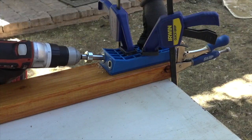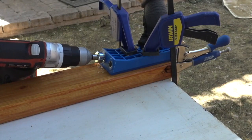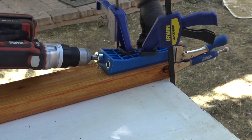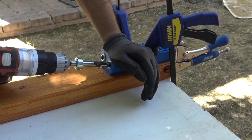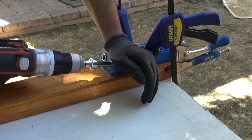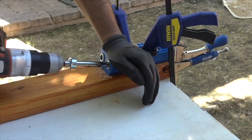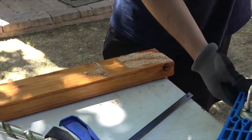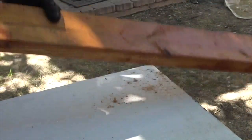So now moving on to the second half of our project, and that is getting the wood beams up on the ceiling of our pergola. We are going to do a floating look. That means that there's not going to be any beams sticking off the side of our pergola. Everything is going to be contained in the frame and kind of give it a look that our beams are floating. My husband is going to make pocket holes on all of the 2x4s, and it is in these pocket holes that he will be attaching to the 2x4 that is already existing up on the frame.